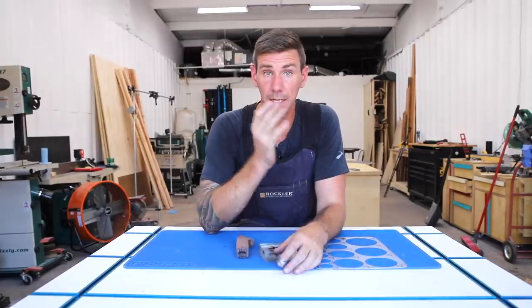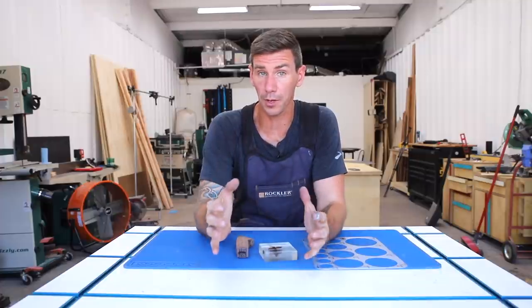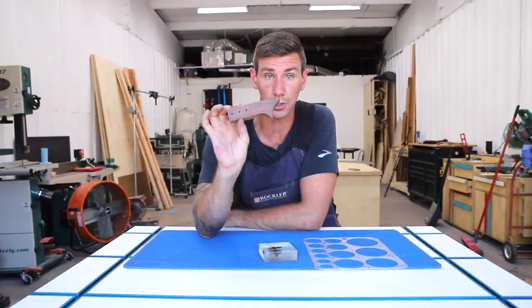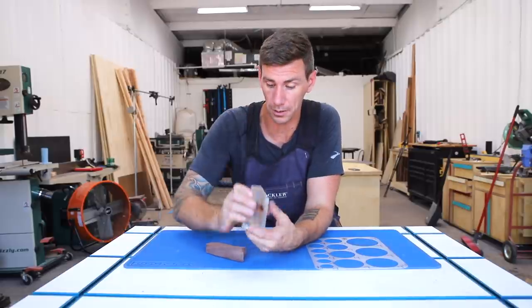Okay, well the blade is in the oven doing the temper cycle right now, and as you saw, the heat treat went pretty well. It skated a file, which means it's hard, it didn't cut in. So now the next step is to start on the handle, and specifically putting the Murder Hornet into the handle.